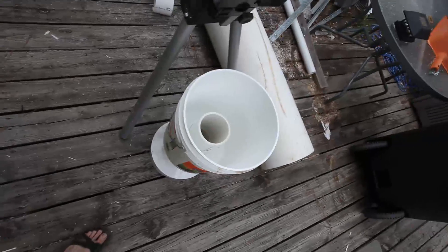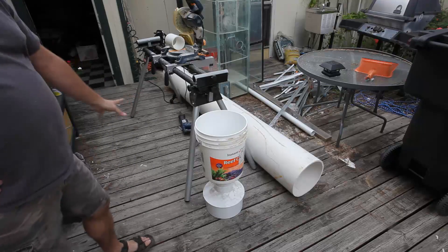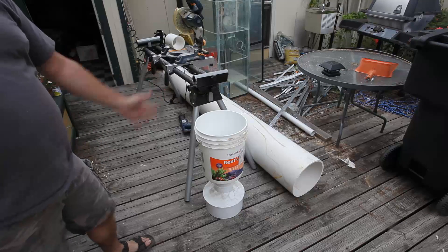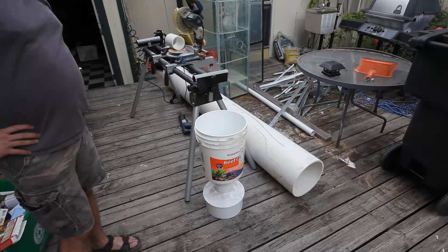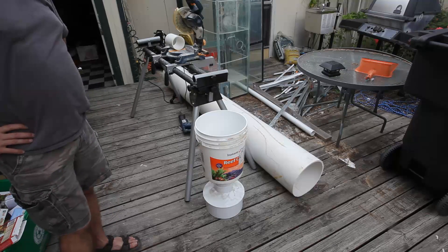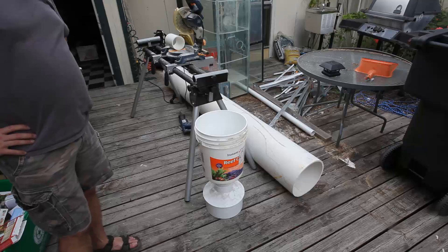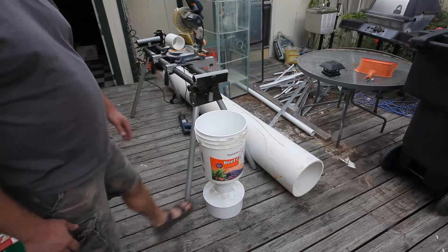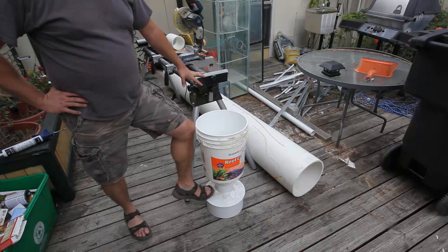There you have it. If I had to buy this fitting it would be horribly expensive. If you're building a smaller version of this, you could use a smaller bucket and smaller pipes. I'm going from 12 inches to 4 inches — that's a 1 to 3 ratio, which seems to be about the ratio I observe in commercial systems. This is actually a 10 inch to 4 inch fitting that I was able to get for free, and I'm going to have to purchase or fabricate something to go from 12 inch to 10 inch.